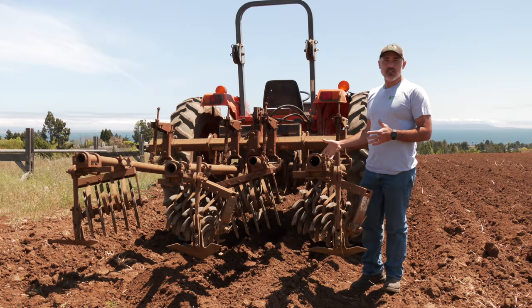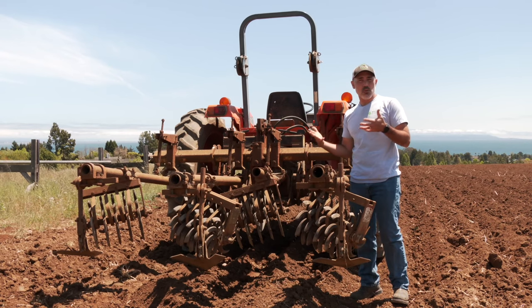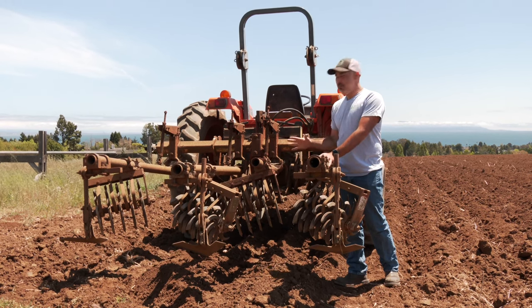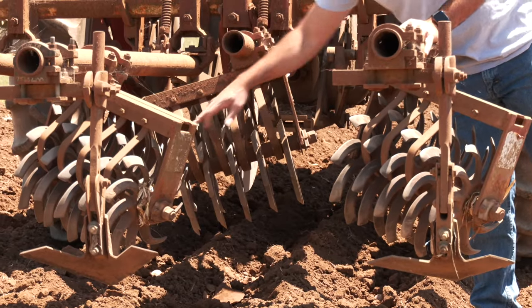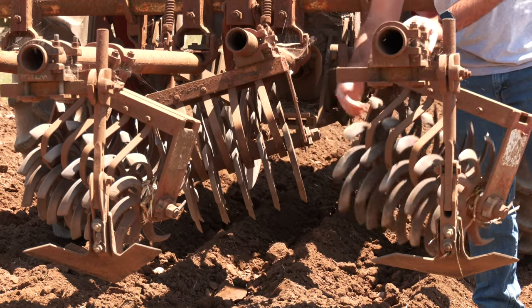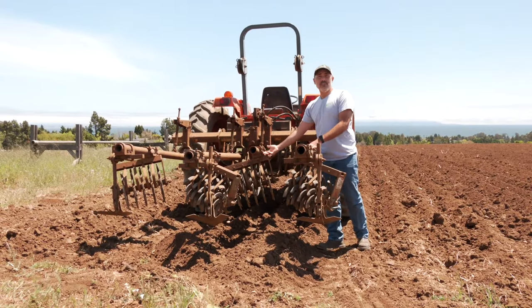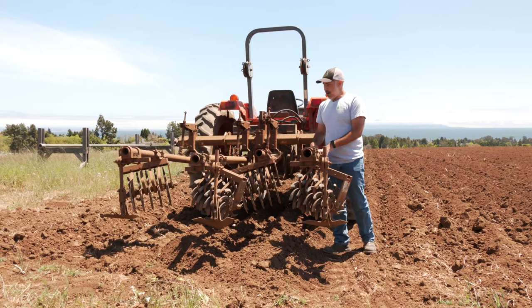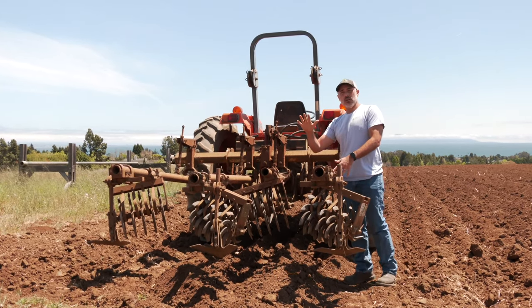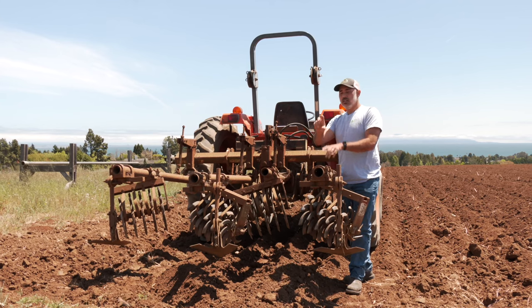So now we've planted our potatoes — they're in the trench. Now we're going to do our first pass to just cover those potatoes with about three or four inches of loose soil, kind of like a first hilling. The way we're going to do it is with the Lilliston cultivator — one of my favorite implements on the farm, mainly because it's just so simple. The Lilliston cultivator has these tines called spider gangs; as the tractor pulls them through the soil, they rotate, and the action of this rotation is what mounds the soil up on top of the potatoes. In this scenario, I'm actually going to have the implement tilted almost all the way forward and drive fairly slowly so we should end up with just a small little divot into the center that has our potatoes covered.